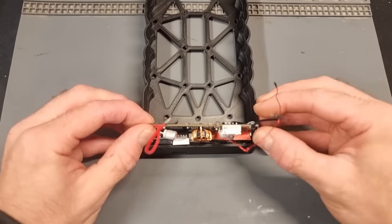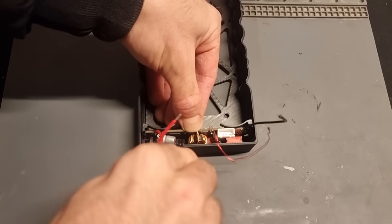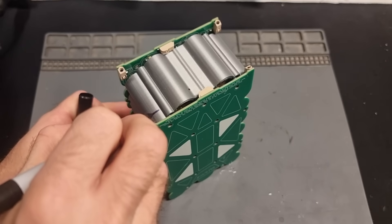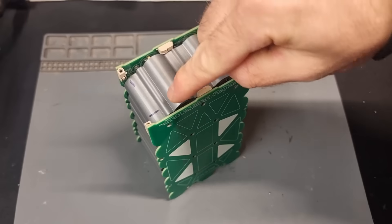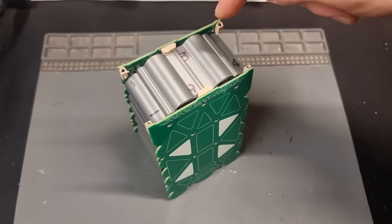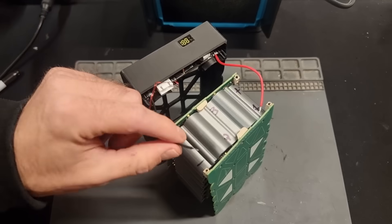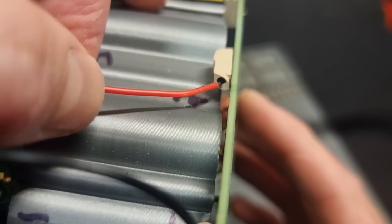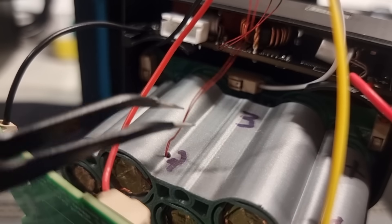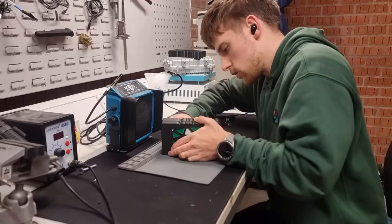Let's get the board clipped into the enclosure — I just need to slide it along these little rails and use something to push the screen to make sure it pops up in the little gap. Once everything is aligned the two tabs at the back should hold it all in place. I find an edge of the board with a row of negative terminals for the ground, mark the four connectors used by the battery management system, and finally mark the positive edge. I slightly tin the wires from the USB board to make them easier to push into the PCB connectors, then working from left to right I plug in the negative wire, the four BMS wires and the positive wire. There's a little temperature sensor which I fit into a small hole so it touches one of the cells. Then I slot it all together, make sure I don't trap any wires, and screw the whole unit together.